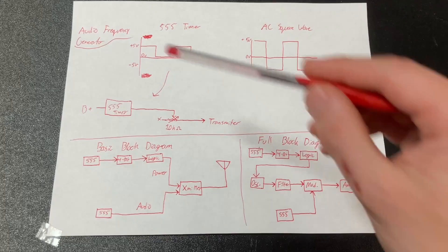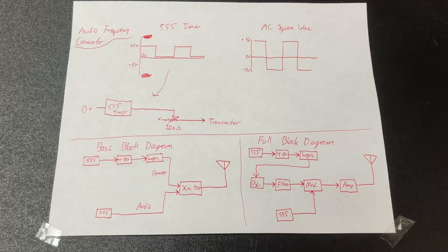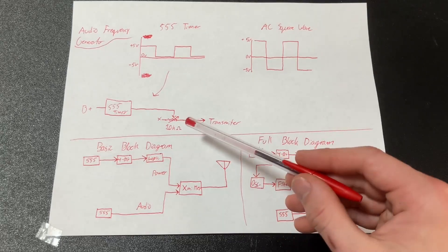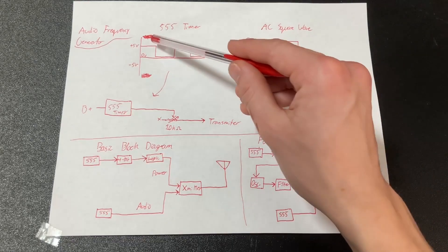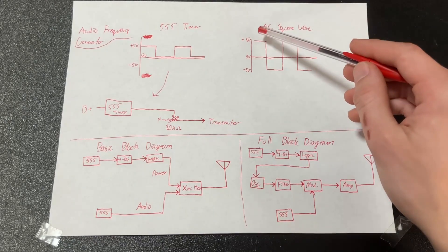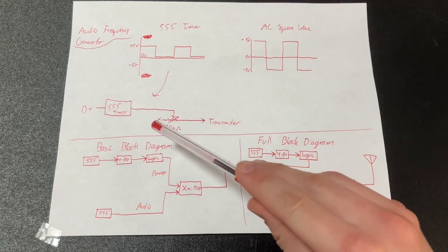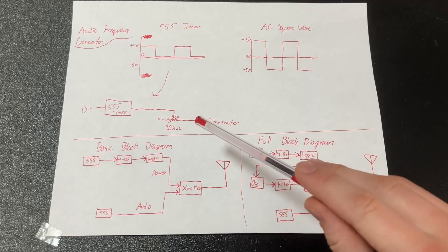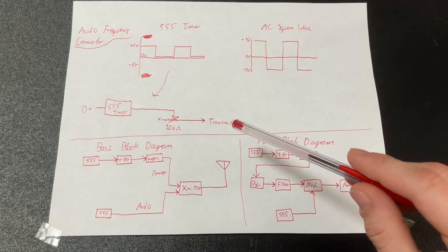The audio generator circuit is very simple — it's literally just the 555 timer, and I send it through a 10k potentiometer before going to the transmitter just as a volume control, although the modulation is so weak I have to leave this cranked up all the way at all times, though it is nice for testing. The 555 timer does produce a square wave, but it's DC, meaning it jumps between 5 volts and 0 volts. What would be more ideal is an AC square wave going between 5 volts and negative 5 volts, since the transmitter is expecting a regular audio signal which is AC. This is a very crude way of doing it, but I just wanted a basic thing that produced a sound at a frequency I could adjust, and the 555 timer was the easiest thing I could throw in there.